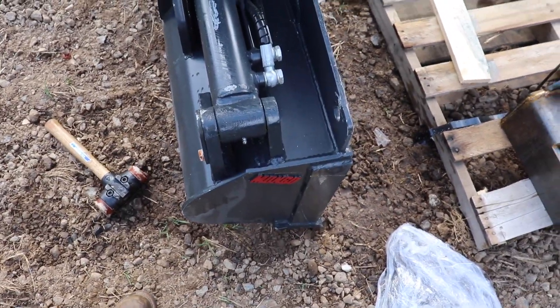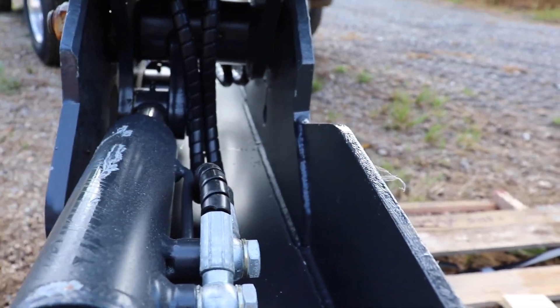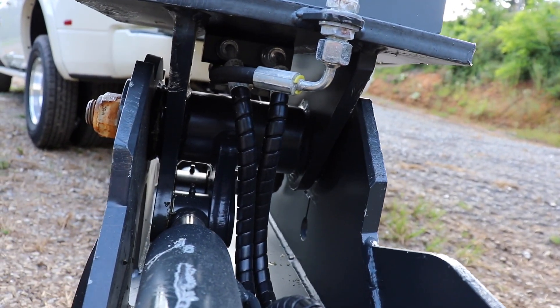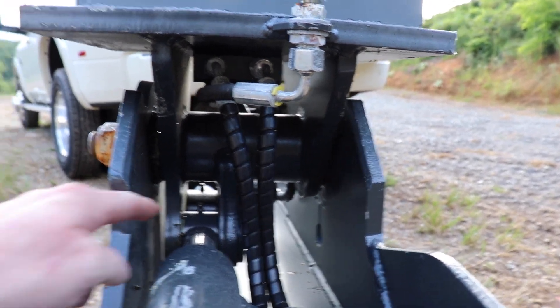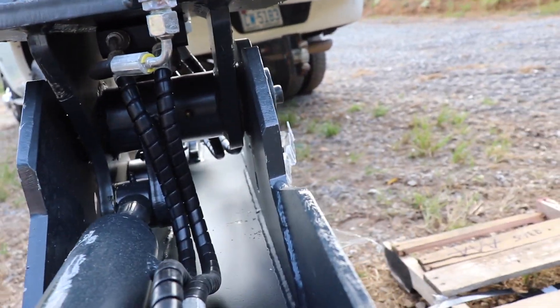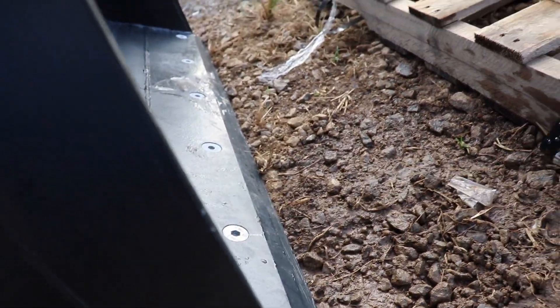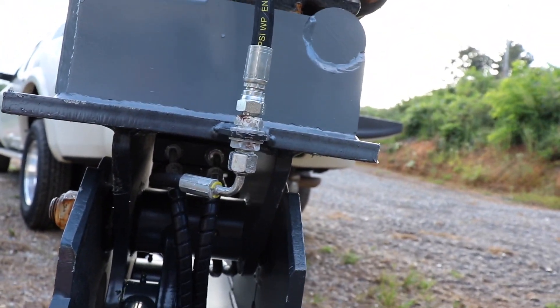All in all, this is a well-built unit. Two cylinders. Looks like we haven't come in contact with anything yet. Looks fairly simple to service — that grease fitting back there may be a little tough to get to. Well-built bucket. It's got sides, got a double edge on the cutting surface there, and you can flip that around. It pretty much came ready to go.